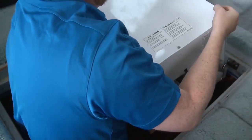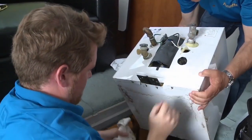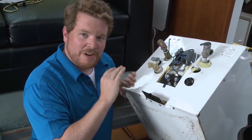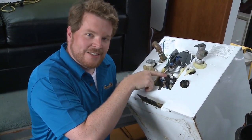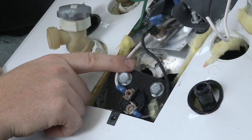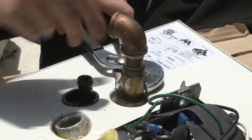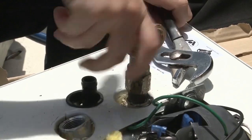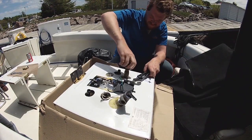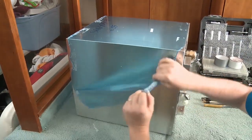We'll pause while taking out the old unit to show you exactly why you have to be meticulous when you winterize your boat and get the water out of everything. This stainless steel tank had some water in it — the power of ice burst it right open due to winterization failure. Not only did the tank burst, but some of the fittings were tighter than usual. It took some extra time and a vice, but we got everything apart.